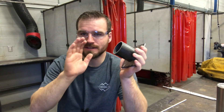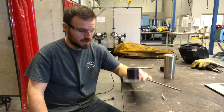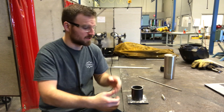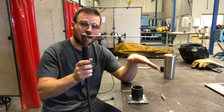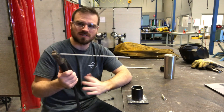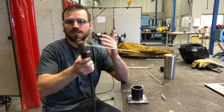Now I've got my pipe to plate all tacked up. Remember, it's just a fillet weld going around a round object. I'm going to show you some tips I use to weld these out nicely. For plate positioning, I like to put my plate close to the edge of the table so when I'm rotating around the pipe I don't hit my hands. I put the rod at a 45-degree down position, or sometimes at 90 degrees and bend the rod down to about 30 degrees — that little bit more flat angle helps me get the bead up onto the pipe versus straight down to the plate.